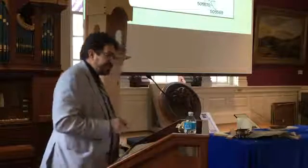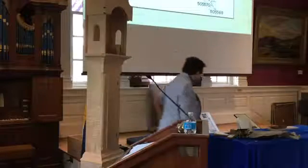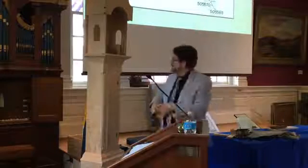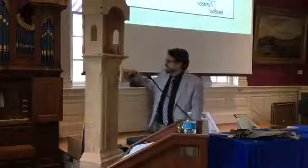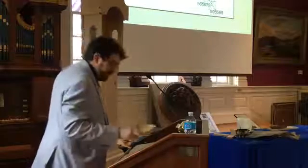As far as a traditional mortise and tenon joint, everybody knows what a dovetail joint is, I would assume. As far as a traditional mortise and tenon joint, which in this area here holds this panel, this is a square frame that encompasses the panel. Okay? So there's mortise and tenons in here. So that's the mortise and tenon joint that's hidden in there. Okay? Traditional on long case clocks. So the bottom facade and the central facade are done in this way. And then they're pegged with wooden pegs, as you can see. Okay? This is in curled maple with walnut pegs in this case.